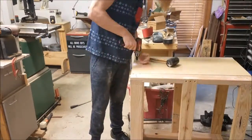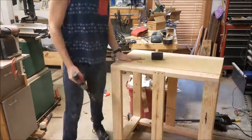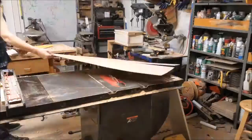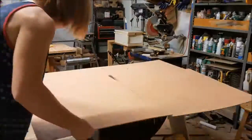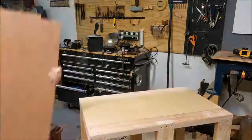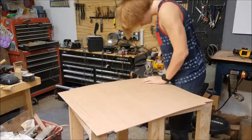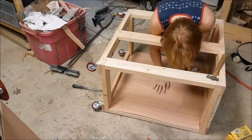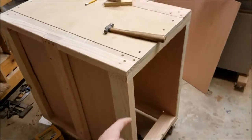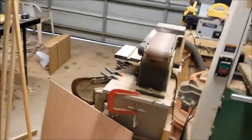This piece of plywood is a 3/4 inch piece. If it's right between the 2x4s, I believe the piece of plywood is 13 inches wide. Again, the half-inch countersink. Now I'm going to rip some of this 1/8 inch down and wall in the sides, because later I want to install some drawers in the middle and I don't want them to get a bunch of dust inside. So I'm just going to notch out places for the 2x4s with the jigsaw and brad nail it down. I did the other side off camera because once you get one side, you understand how to do the other.